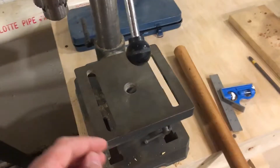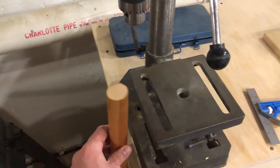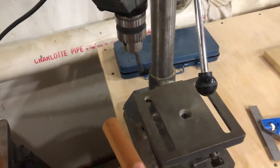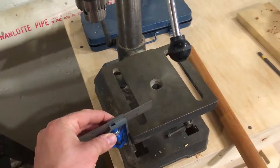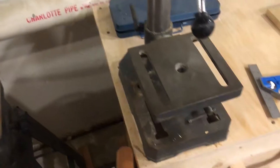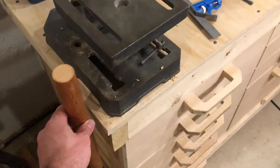My thought is to make a jig that references the nice flat horizontal surface of the drill press table and has a nice 90-degree angle, so that the dowel could be held off to the side of the drill press table and then just swing the head of the drill press in line with the end of the dowel. The sides of the drill press table and stand are surprisingly not vertical relative to the horizontal surface, and the stand is also not 90 degrees. I also thought of using the side of my workbench, but it's not exactly even — not a great surface to reference.